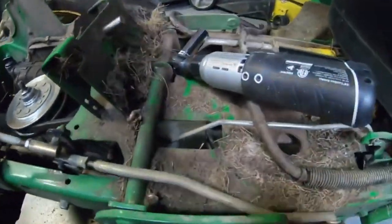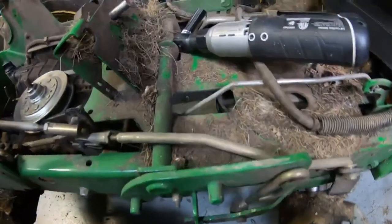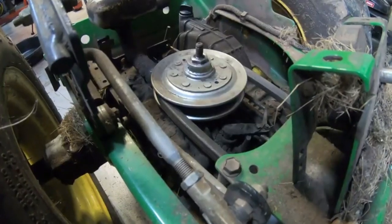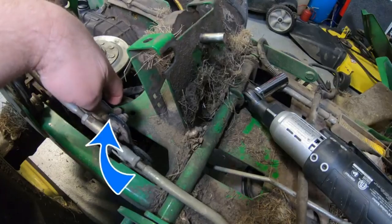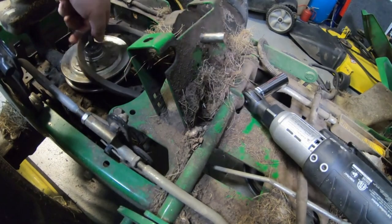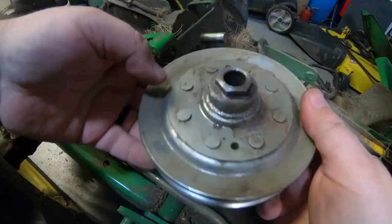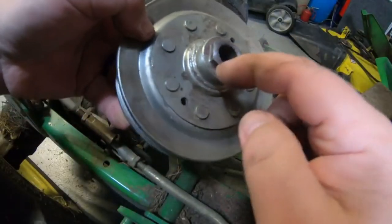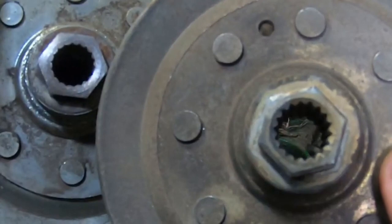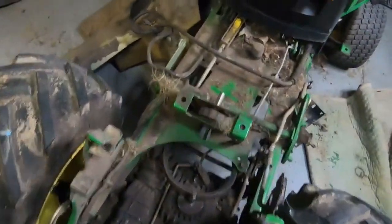To get this belt off, reach underneath here — you can see this pulley right there, the one closest to your mounting bracket. If you're on the right side of this mower, reach underneath with your right hand, pull that back, and that takes your tension off so you can pull that belt off with your left hand. Put your finger on the belt, pull this tensioner back underneath, and then just walk that belt off. You can see on this pulley there's not much spline left — it's definitely been run loose and just started wallowing the inside out. I'm going to push this outside and pressure wash it off so when you see it next it should be a little cleaner.